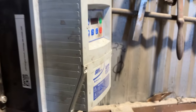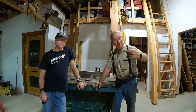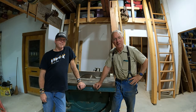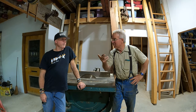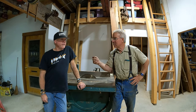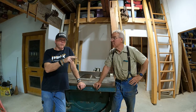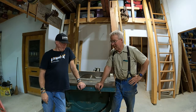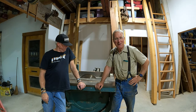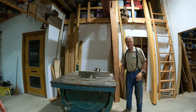I'm always thankful to have somebody like Kevin around to bail me out. I'd like to tell you that when I push this button it's the first time running this thing since it came out here from the East Coast — but it's not. We tested it about 10 minutes ago and the rotation was backwards. With three-phase power, if you get two of the legs reversed the rotation reverses, so we switched the A and C phase, and now it's running straight ahead. It is terrifying to hear the power and the momentum in this 16-inch blade — and that, my friend, is a table saw.